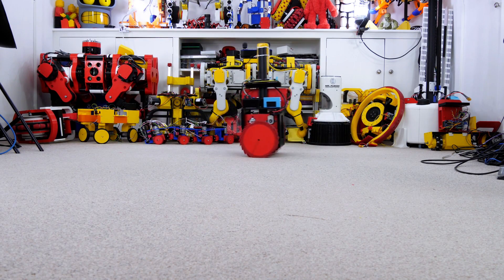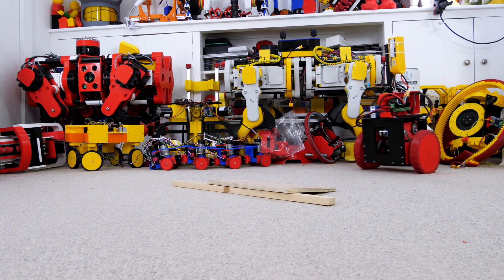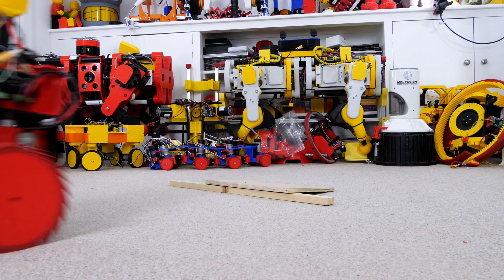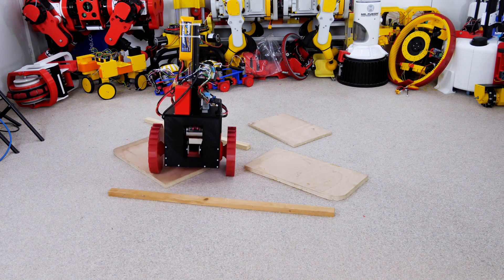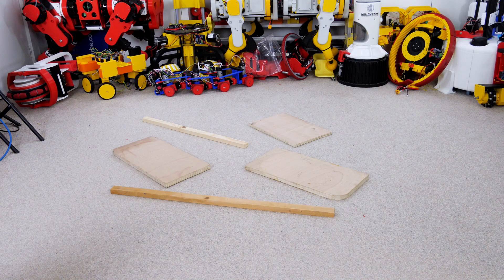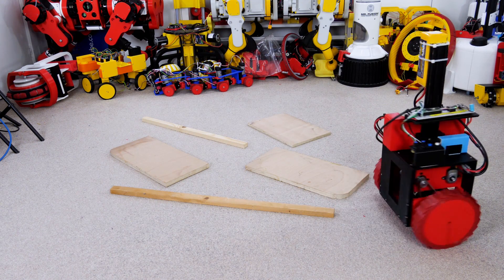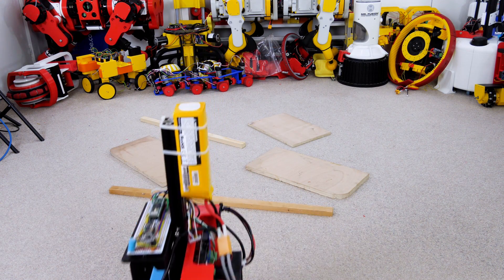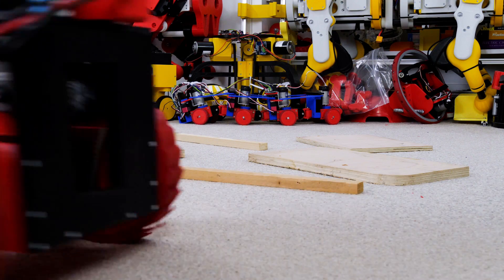What we wanted was a robot that could drive over some obstacles, so let's try a little ramp and see how stable it is. It looks pretty good - it seems to handle coming off the ground and going back down, or one wheel coming down first, so that's pretty good. Driving backwards and forwards over all these pieces of wood with little jumps and ramps, it doesn't go crazy when one wheel comes off the ground. Those extra wheels with the flappy bits are helping to grip, and this has done better than my omni tank which couldn't even drive over one piece of plywood. I'm pretty happy - it's a two wheel balancing robot and it's definitely more controllable than when I had the rotoped tracks on.